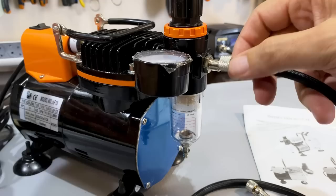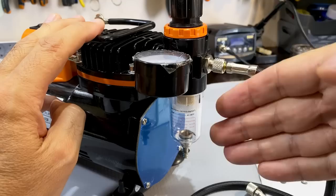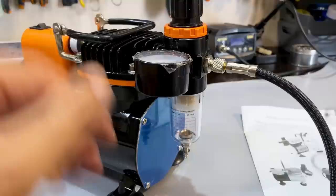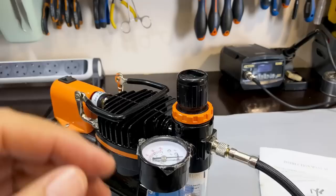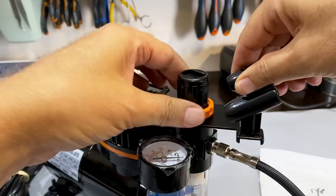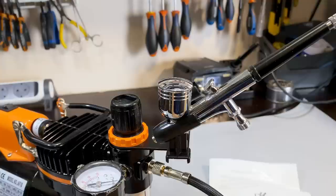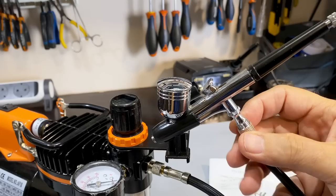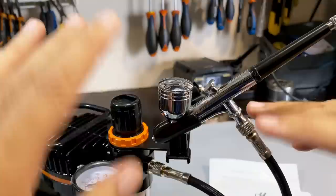This particular one already came mounted, which was a good thing. When you mount it yourself you've got to use some PVC tape and make sure it's vertical. This is the setting for the working pressure. The kit also comes with a gun holder — you tighten it in place and your airbrushes just fit in there, with space for two. The other side of the hose connects here via a quick-clamp system. This is exactly how I got it, nothing extra added.